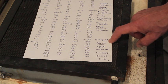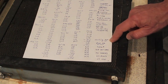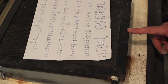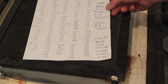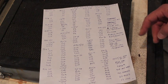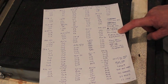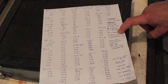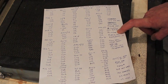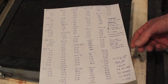My energy cost per melted pound was 8.5 cents, but it was actually another 11 cents a pound for overhead. So it's a great little, super energy-efficient furnace that basically melts glass for under 10 cents a pound. My average daily energy cost is $3.47 a day — that includes every day the furnace was in use, including running it up and the days it was idling, not just the days I was charging it. That's $3.47 to keep it running 24 hours a day, which is pretty good.